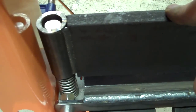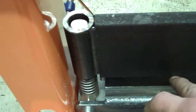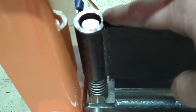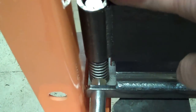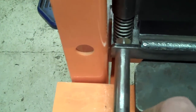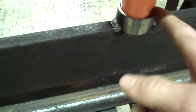The top die consists of four-inch, three-quarter-inch thick flat bar that's been machined to a 60-degree angle on the bottom surface. You have your three-quarter-inch rod, three-and-a-quarter-inch DOM tubing, two springs, your fasteners, your three-quarter-inch guide rod, as well as this little cup here to make sure your die is centered in the press.